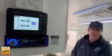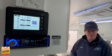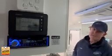Because they're lithium batteries, they'll give you good performance, and then suddenly they'll shut down. They'll get to the point where they go to sleep mode. If that happens, the only way to wake them up is to actually jump start them. So avoid doing that. You really don't want to do that. If you're getting down to say 8, 7 hours, charge them back up again. So that gives you your power calculation.